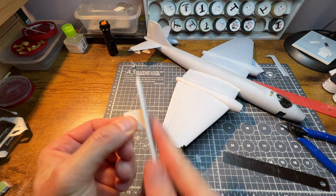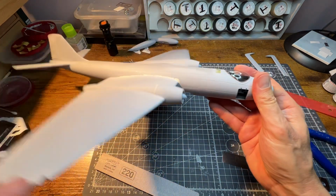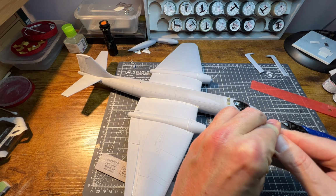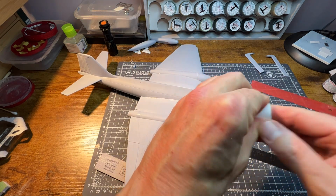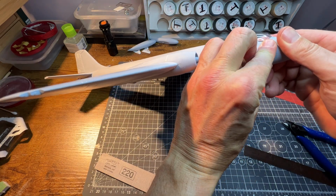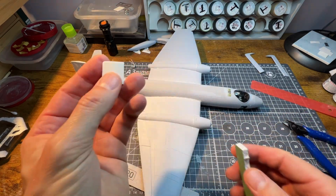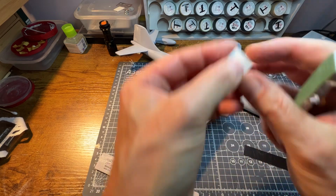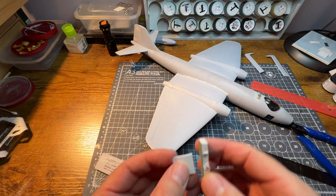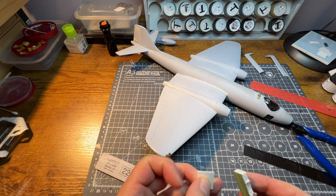now what we can then do is get to a point where this door will fit here pretty much. Just gonna bend that slightly just across my finger here. So that's just about there actually. So what I can then do is go for a slightly smoother file, and what I'm going to do is then just curve that surface there and try and make it match that top surface.